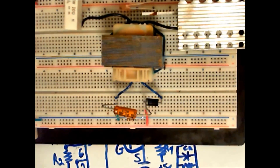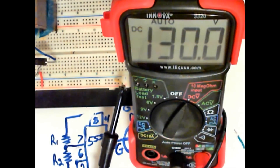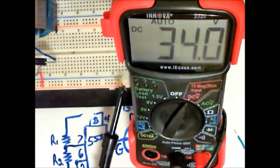Alright, let's fire this up and see what we got. There we go — the wire was loose. We have about 36 volts at 5 volts input. At 12 volts input we have 127 and it's rising. As the current goes into this transformer it's going to build up current, which in turn builds up voltage. And then we have about 130 volts coming back out — that's expected. So that is a DC to DC boost converter.